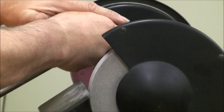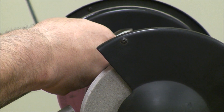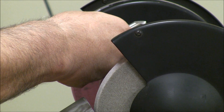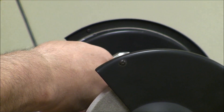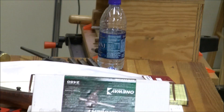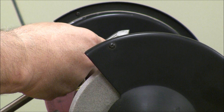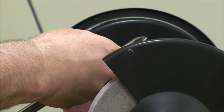These two tools were set up — one using that Raptor setup and one using a traditional setup. The problem is there's no variation with the side cheeks. As I said earlier, that leg brings it in so that these side cheeks roll in. You don't want vertical cheeks on the side. This is a typical grind — can you see these cheeks, how they come in? You can also see that it rolls in 16 degrees different than the front angle. Using their method, same tool, same profile, same angle — look how vertical these cheeks are. There's no angle at all.